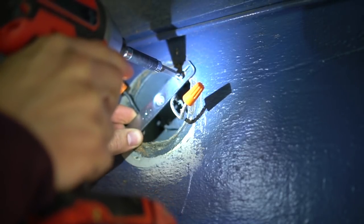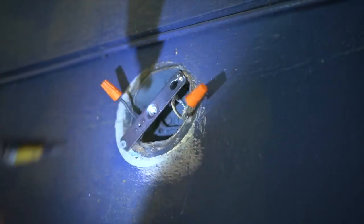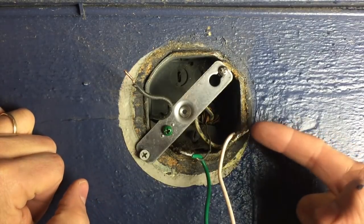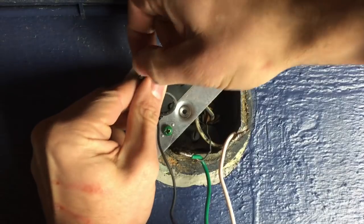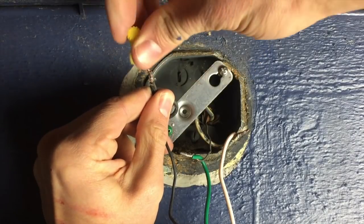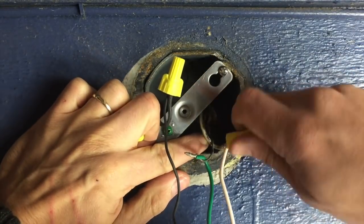I first secure the mounting bracket to the electrical box. Unfortunately in my case, this electrical box is not standard and it's very small, which is why I kind of screwed into the side. Not preferable, not what you want to do, but it's what I did in this case — hopefully this is not what you have to deal with. Now: your white is your neutral, your green is your ground, and your black is your hot. Just a little electrical 101 for you. Take your electrical wires coming out of your box and connect them to the wires protruding out of your security floodlight. Take your wire nuts that are included in your assembly package and screw them on nice and tight. And again, just as a reminder — make sure the power is off.